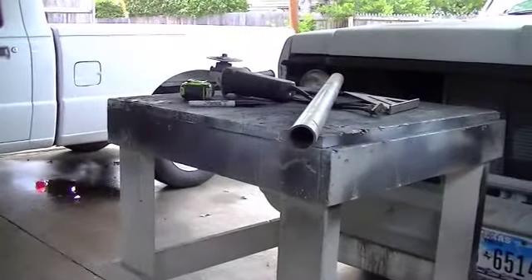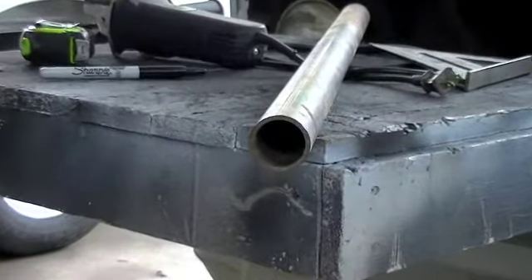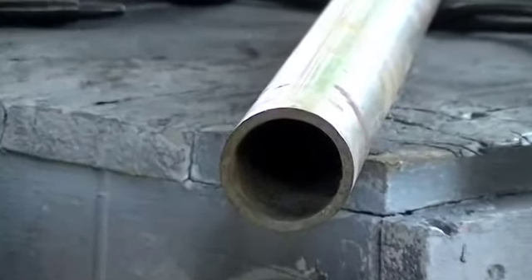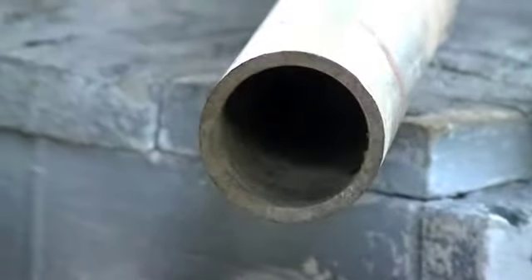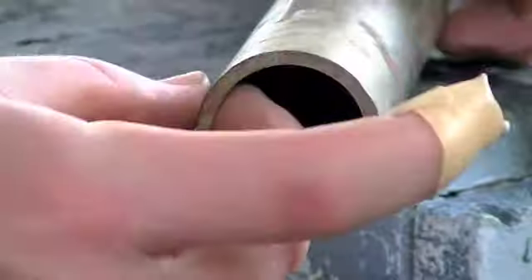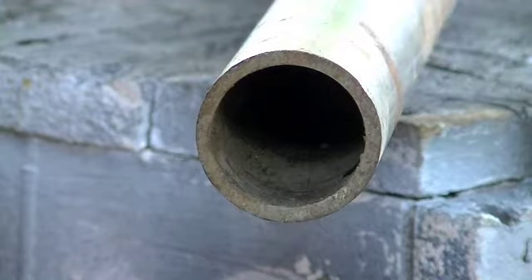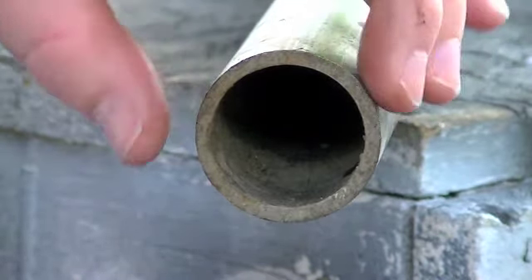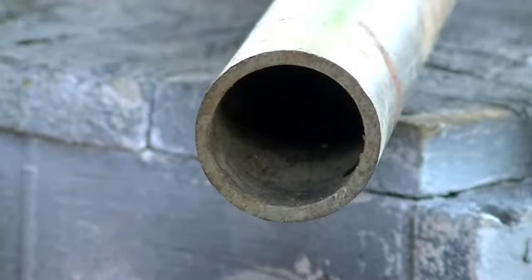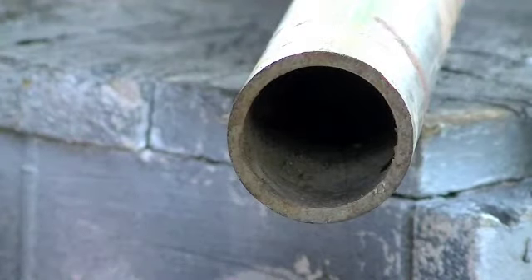I've got some material here — this round tubing. It's just regular old HREW, which stands for hot rolled electric welded. I really wish I had some thinner wall material. This is a 1/8 inch wall, or a 0.125 wall thickness. I really wish I had something closer to like a 0.063, but I don't, and I don't see it necessary to go to the metal store and buy some. The only reason I want thinner is this is way overkill and it's heavy, but it's what I'm going to use.